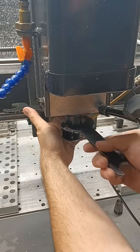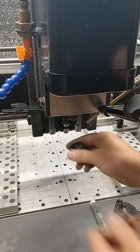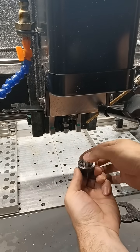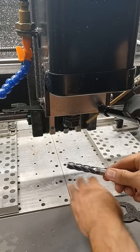The reason that's important is after you load your tool, you then need to touch your tool at that same reference point so it knows where your Z is. Make sure you blow any debris out of the collet if you want adequate performance.